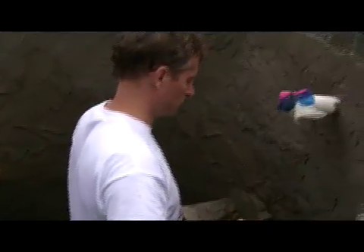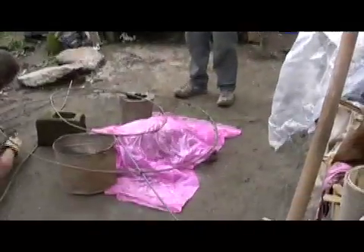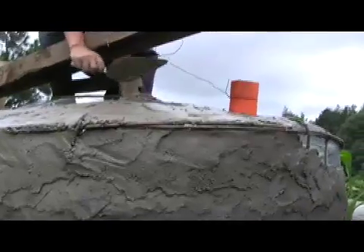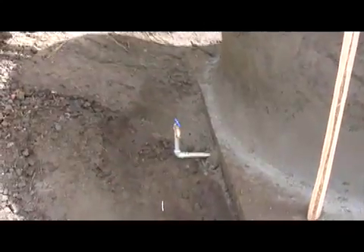With the wall thickness suitably thick, we were able to start work on the dome, which consisted of three-quarter and three-eighths inch rebar and more wire mesh. We could then apply a thin layer on top, and once that set, apply more and more layers to build wall thickness and add structural integrity to the tank. We then worked on the rainwater collection system off of the existing tin roof, so that once the tank was hardened, we were able to route water off of the roof and into the tank for storage. That water is accessible via tap at the bottom of the tank.